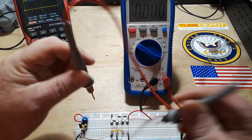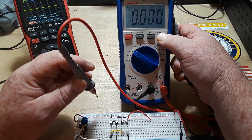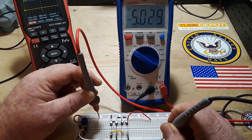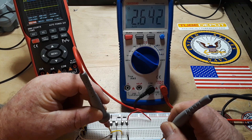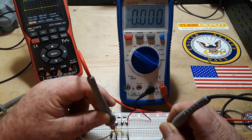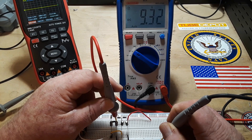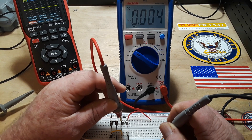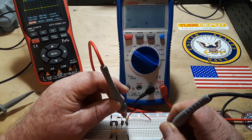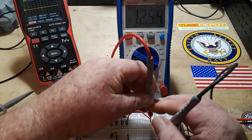Let's take a look at some of the voltages along the way — maybe that'll help you understand it a little bit better. So again, there's our rail voltage: five volts. Coming out of the 555 timer: two and a half volts. At the next node we're at zero volts, but if we come and look on the top side up here we're at nine volts. Then we move over to the next one: eleven volts — close enough. And then we come over to the last one and we come out to just about thirteen volts.